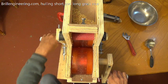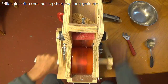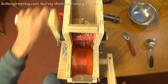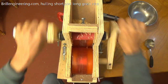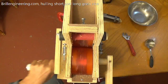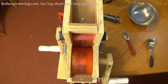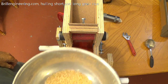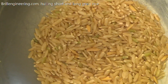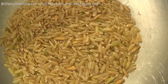We're going to open up my chute. Get this one going — this is my fast roller. Get my slow roller going. Now we would like to separate this, but we don't know how to separate the long grain rice. The short grain rice I can separate out, but this long grain — the difference just isn't great enough between the husked and unhusked. Commercial units all separate so they don't have to rerun any of the rice. So now we've made four passes; we're going to stop there. It's at probably 99 percent, but those few grains that still have husks on would have to be picked out individually.